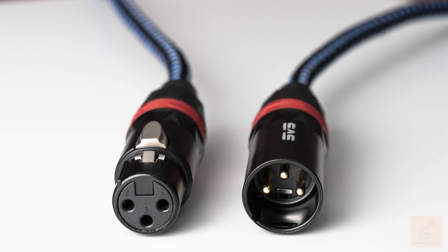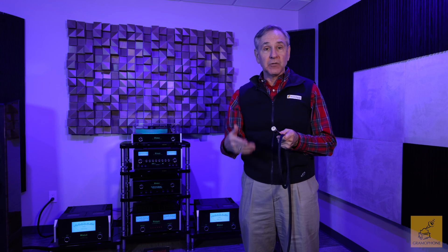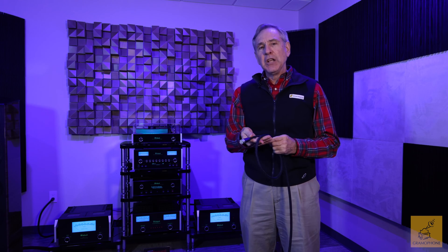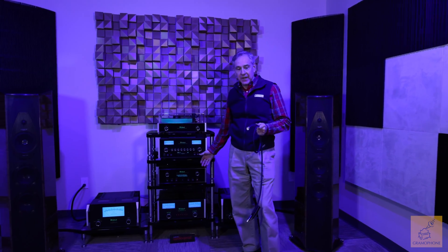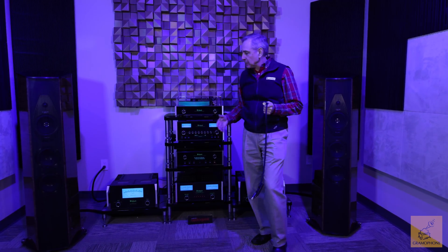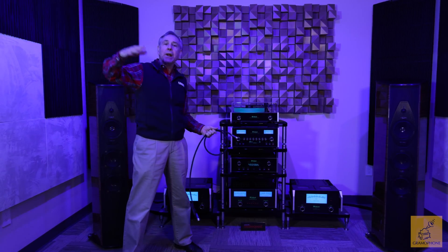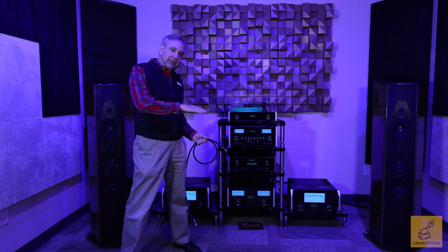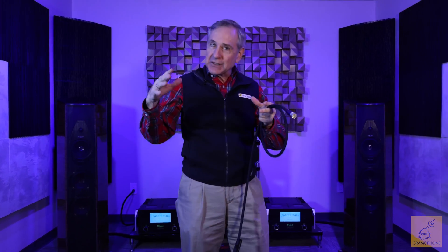The circuit now reverses the 180-degree out-of-phase signal on the second wire, so the two signals are back in phase minus the noise. With a balanced cable, you typically will pick up about a 6 dB increase — 6 dB more gain versus an RCA cable. If you've invested in a nice system to get the most out of the equipment, go with balanced cables, because you're going to get a greater dynamic range. That distance between the quiet passages and the loud ones will be much more like live music — it'll sound less compressed and more like a really live music performance.